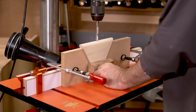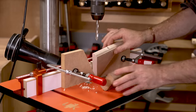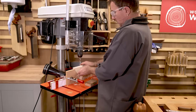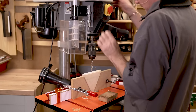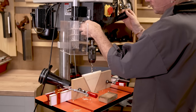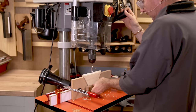Initial bit, we're going to get the lip and spur to work. Slow feed in down to our depth. Let's have a look. I reckon we've got to go a little bit deeper. So let's just grab a handle, we'll come back. So that'll fit. Yeah, I need to go in a bit more. Okay, easy to do. Back in place. This one I want to realign with that hole, so I'm making sure that I put it back in. Just from knowing what we've looked at, I can adjust our depth a bit more, that's good. Support it with my block. Gonna wiggle a little bit. There you go, right, so.